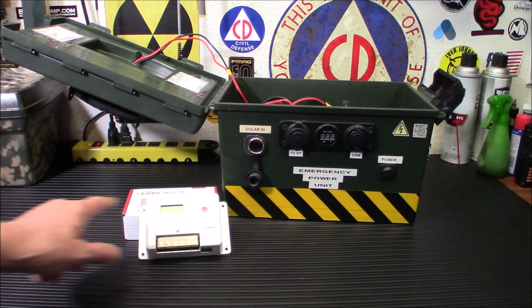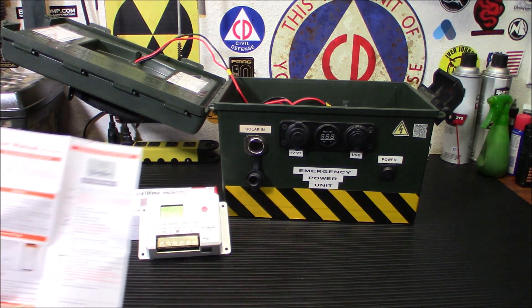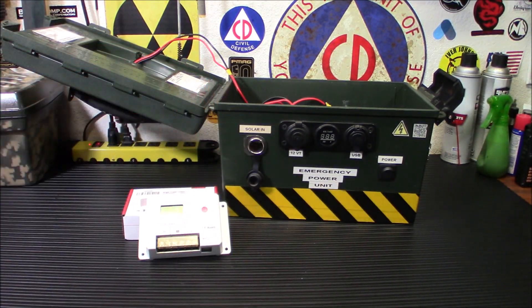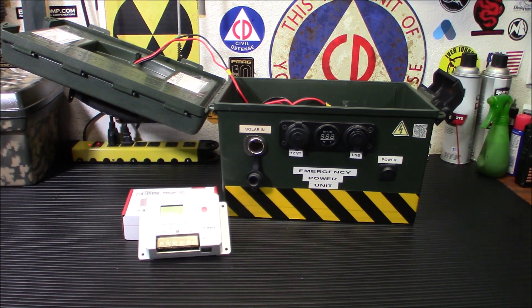I am going to set it up — there are setup instructions here. I am using a gel cell battery, so I want to make sure I'm not overcharging it. You don't want to do that. Your peak charging volts shouldn't exceed 14.7. It should be a high of 14.1 and a load off of about 11.6 on a gel cell battery. The load should be set to come back on at about 12.5.